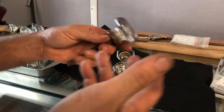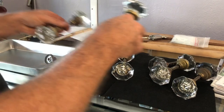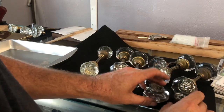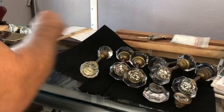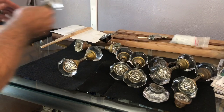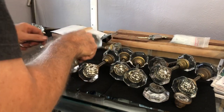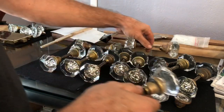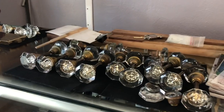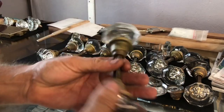A lot of areas have old house type depots where they take salvage stuff. The real deal knobs - the brass is made a lot better, the screw retainer, everything's just better, as with anything back then. But I do want to talk about one important point: if you have a house with a bunch of these doorknobs and you start having trouble with them, there's one really important thing you need to check - make sure they have not loosened. Unfortunately when they do loosen, there's no real coming back from it.